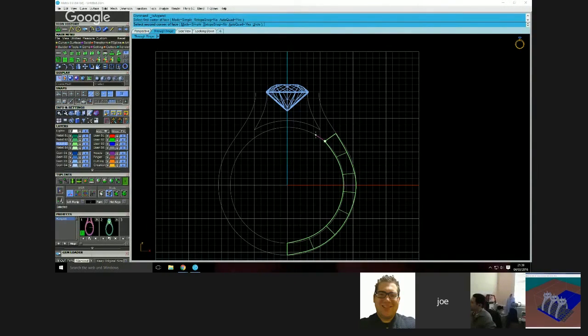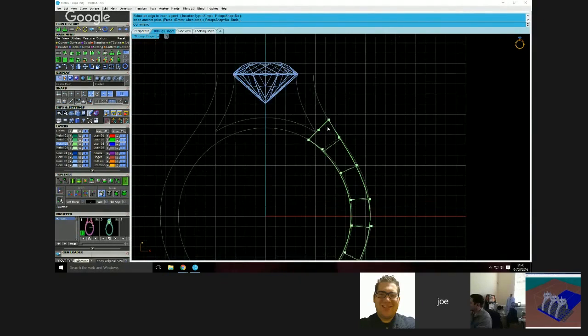Because we've got a split here now, I made it shorter, and then add a simple point, basically just there. And what that's done, if I turn the points on, is it's added that there. That's why it's called T-Splines, because you can start the spline from anywhere you want. So I can split this off into two now. I've got mid snap on there. Oh, that's the wrong command. So go back into append.